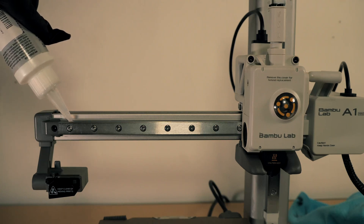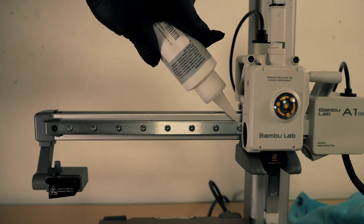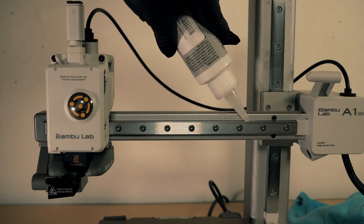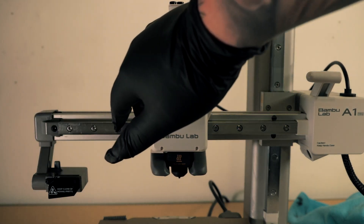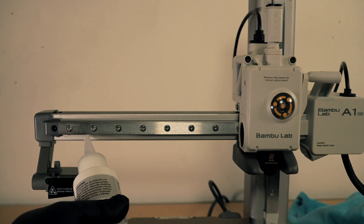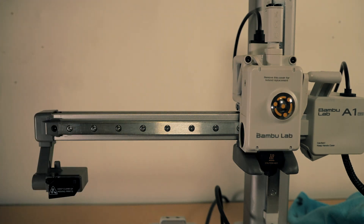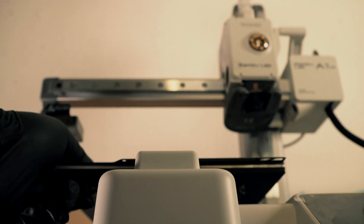You can see I actually think I overdo it here, but it spills — just clean it up, you'll be fine. You're going in that groove where the bearings are. When you're done lubricating, make sure you get both sides as well. Move your tool head out of the way to get in there, and move your tool head back and forth. Make sure you do the underside of the linear rail as well — that's really awkward because the oil is a liquid and you're trying to do it upside down, fighting gravity. What I decided to do is just tiny, tiny bits — be really careful. If you take your bed off altogether, that's probably the best way to do it — just take it off the magnet while you're doing this.